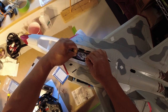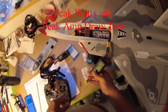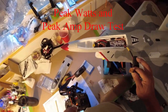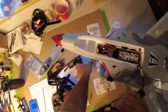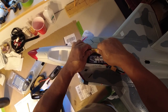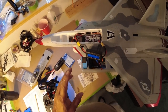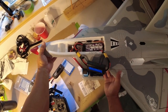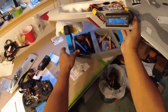We just did the thrust-to-weight ratio — as you can see it went straight up — and this is set for 30-degree high timing. We're going to do a watt test to see how much power we're getting. I just recharged the battery using the LIHV setting, so let's go ahead and test this out.